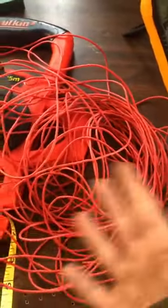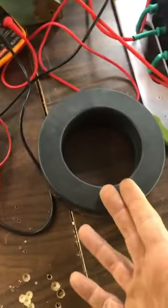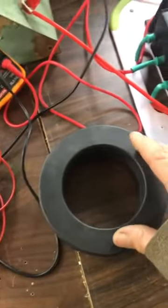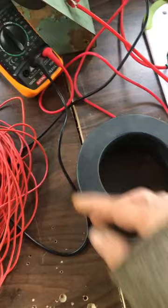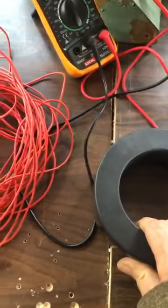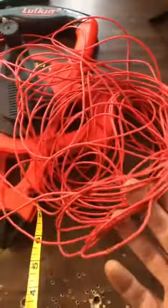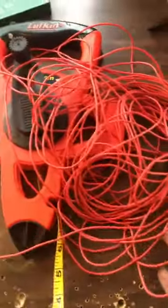Right now we're going to get this configured and get that put on here in two secondaries — extra coils. And then we're going to attempt the one wire on here, which I'll have to go around, do the same sort of thing, see what fits in length, and then determine my operating frequency of the primary to the secondary based on the amount of space I have on here. I expect the primary is going to be somewhere — I won't get the same length on there, I won't get 58 feet — but somewhere in there we'll work at it. That's what I got for you guys. Ciao.